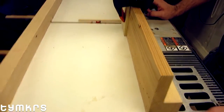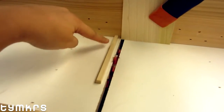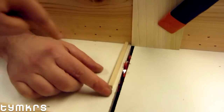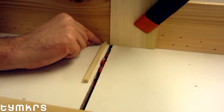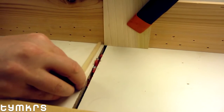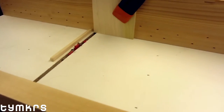And then to that, that's when we had this piece of wood here, and if you look here to where this box joint jig, I was calling it a peg. So we actually did a hole. I dadoed a hole into it, then stuck the rod that slides into it in there. And you guys will see how it works, but it was actually pretty easy to make.